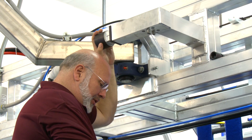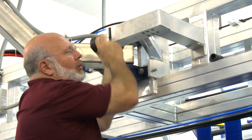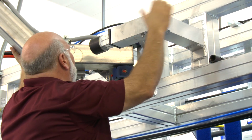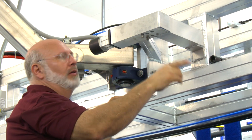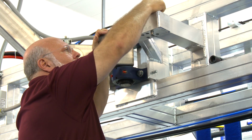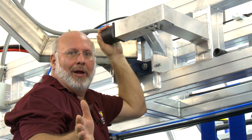Stainless steel spring pins, pull those out and release them. And those release these 2 pins here. All we do is push these up, take them out, and then this bumper assembly can be pulled out another inch or so. And we can actually make it less aggressive on the front of the vehicle if we'd like. And it'll hold our unit out a little bit further. If we want to have some increased pressure against the vehicle, we slide these out again, push our bumper in, and come in here. And we've actually brought our brush closer. Okay, we've shrunk our little spring assembly, but we're letting the brush come home a little more and get a little bit more action in the front of the car.